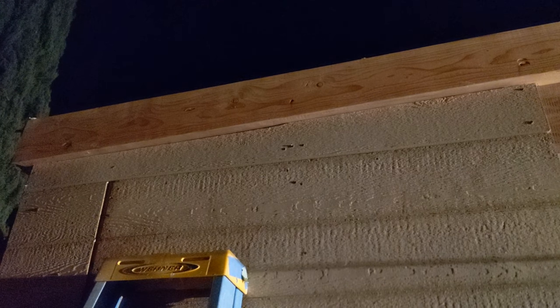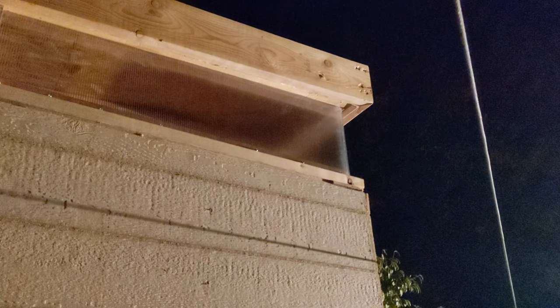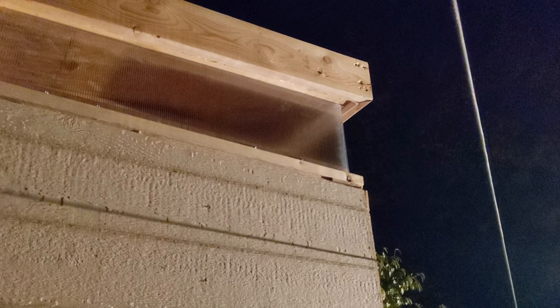For those interested in the technical specs, the roof cantilevers a little less than half, otherwise it's bearing on this wall. It's tied down with a metal strap in the back corner that ties to the studs, which goes down to the bottom and has another bracket bolted through the concrete with nail holes into the same stud — so this thing will not lift off the concrete no matter how much force is applied to the end. I added a block to stop it from springing a little bit, but technically it all holds just fine.